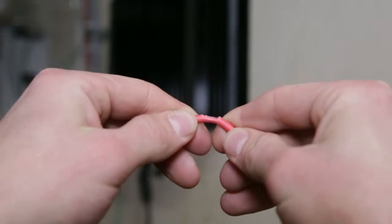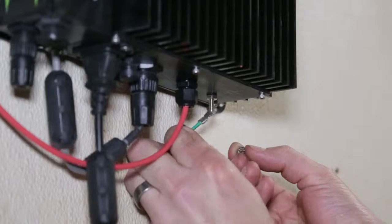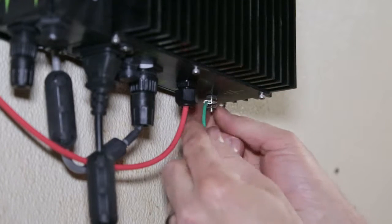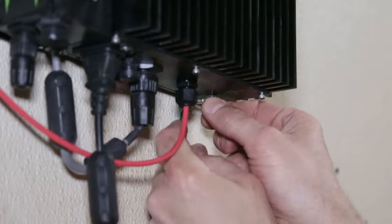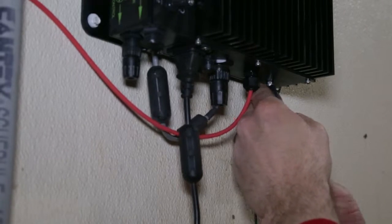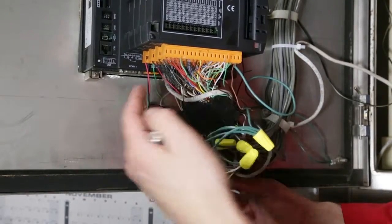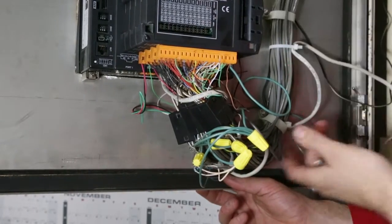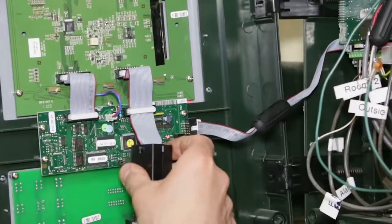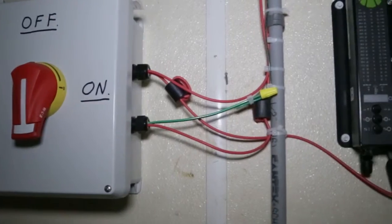If the high voltage wire is scored or nicked, it must be replaced and cannot be repaired. Attach a ground wire to the ground stud of the power supply and connect it to the AC electrical ground. There are 2 ground studs on each power supply. Attach a ground wire to the second ground stud and attach it to the ceiling or other metal material that connects all rooms energized by the power supply. Install the non-automation caps and the 5-pin connector. All computer equipment, controllers, and other sensitive equipment must be grounded properly prior to energizing the power supply. Ferrite collars must be installed on probe wires prior to energizing the power supply. Add ferrite collars to the high voltage wire and computer wire.